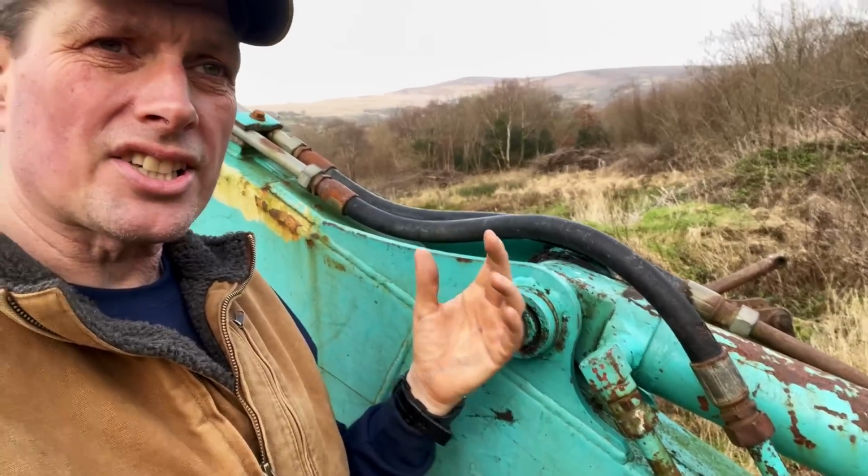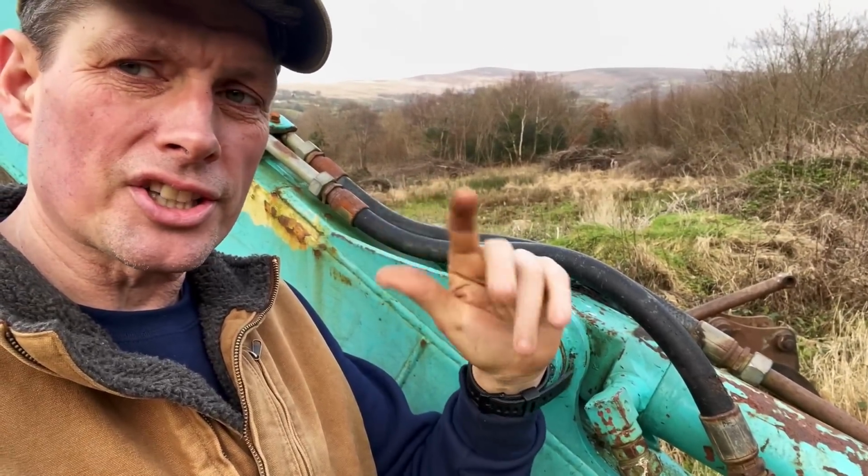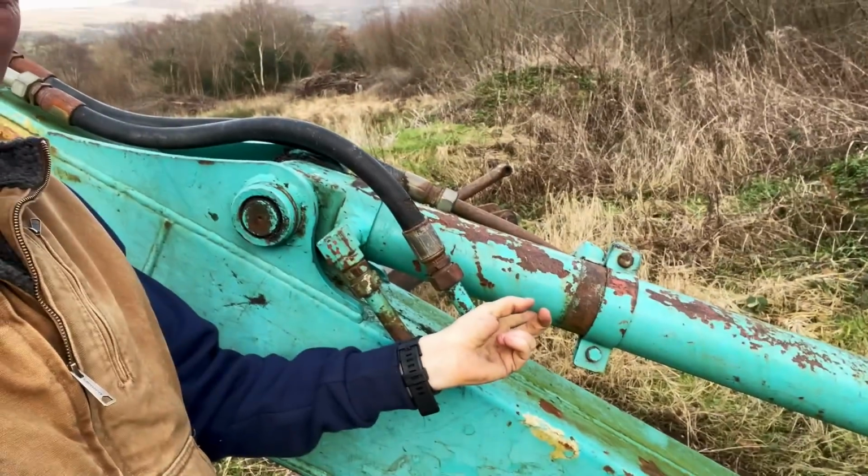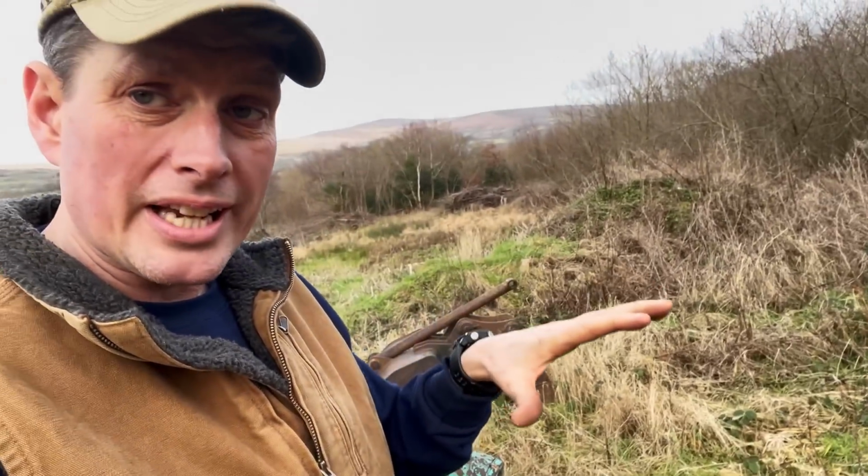So a bit of grease just to make those two things run nicely and to reduce the wear in that phosphor bronze bushing. You've lost all that and you've now created two friction surfaces and they're going to fight to the end. And as I said, that ram's still trying to give it all its power. It doesn't matter whether it's on a little 0.8 or an 8-tonner or an 80-tonner. It's still going to tear out somewhere.